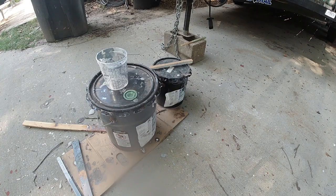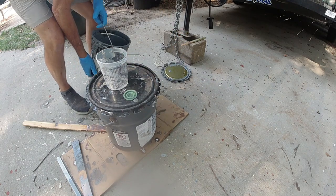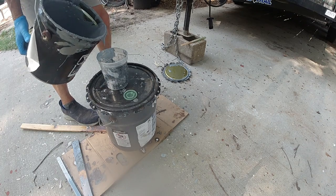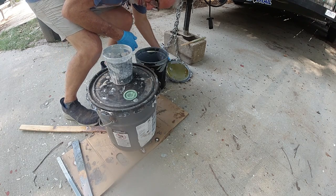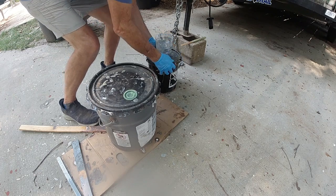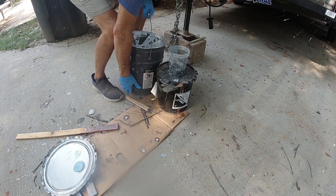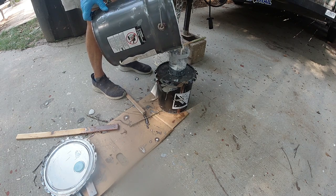It's perfect. This is the Dura-Plate 6000 I'm mixing. Reading off the cut sheet from the internet: Dura-Plate 6000 is 100% solid, high-build, high-strength, reinforced epoxy lining for concrete and steel in severe service environments with fast return-to-service times. Features glass flake reinforcement, hangs up to 125 mils, single-leg or plural-component spray application, 21-day recoat window, 10-hour return to service, extremely low permeability. Recommended uses: severe wastewater immersion, sewer collection systems, wastewater treatment plants, industrial tankage — suitable for use in USDA-inspected food processing facilities. Sounds like I got the right paint.